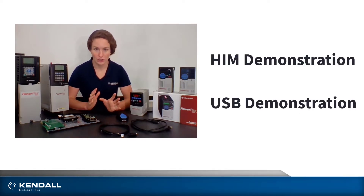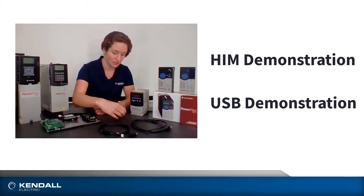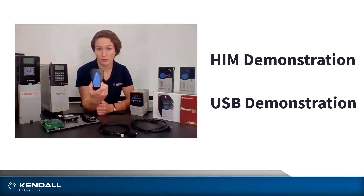Hi, my name is Erin Murdock, Automation Engineer at Kendall Electric. Today we're going to talk about setting the IP address in a PowerFlex drive. This video should save you some time from flipping through the manuals. My agenda for this video is to talk a little bit about the hardware involved with Ethernet communication, then do a demonstration using the HIM on the front of the drive and a demonstration using serial communication via 1203 USB.